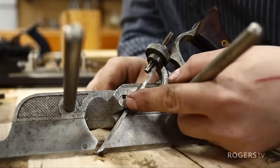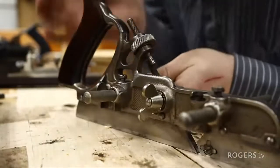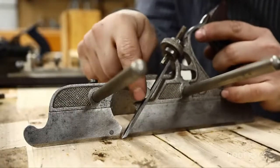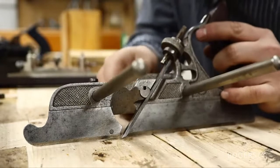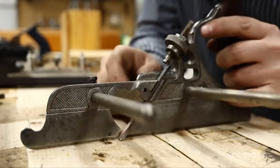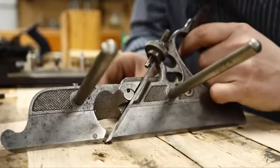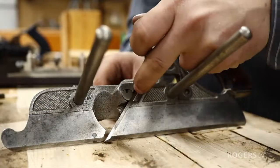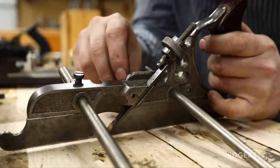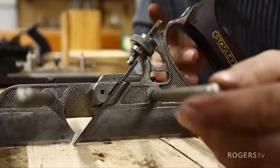And right here, remember on that record we have that retention screw to push in. This right here, a big wing nut, and this is a cam style system. So as we tighten down, this is wedged. As we tighten down here, this big cross pin draws in, wedges down and in on the blade. So it'll pull it into the chassis, into itself, and keep downward pressure. So instead of having a device for keeping it in and a device for tensioning like on the record, we have one thumb wheel here that does it all. So this would have been pure luxury at the time, pure luxury.